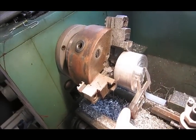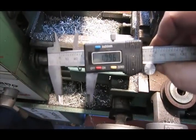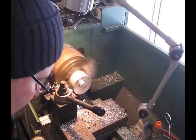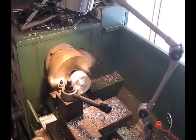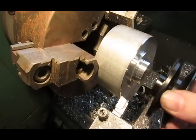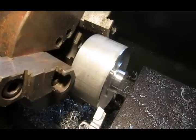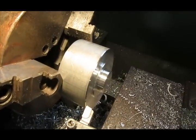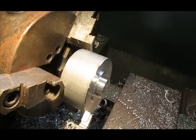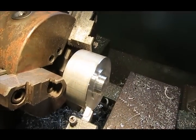Let's see how close we came to 1.1 — it's 1.096, four thousandths under, that's close enough for me. Now that I have my step machined in, it looks about right — it's kind of a mirror of the original. I'm going to reduce the diameter a little bit — not quite as far down as the original, because I want it to spin a little slower, so by making it a little larger in diameter it won't spin quite as fast. We'll machine this surface down a little bit, and then we'll be ready to start cutting the grooves.